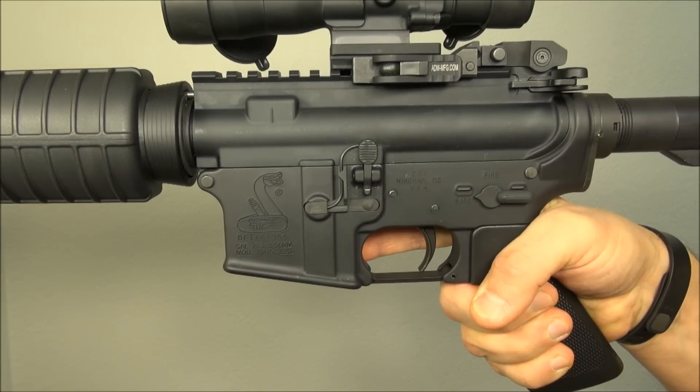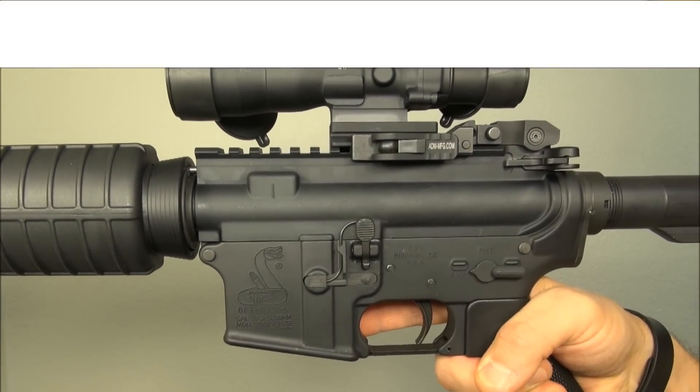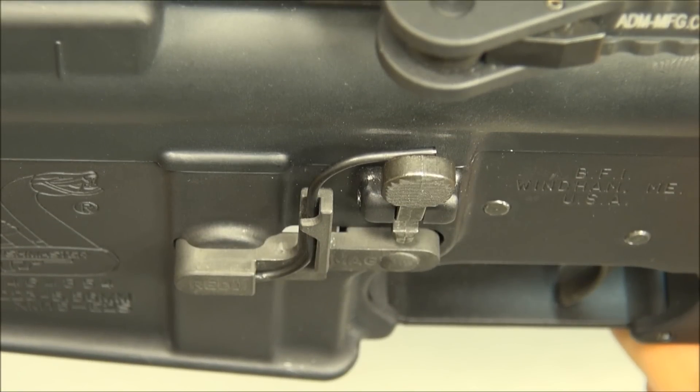Because of the elasticity of the spring steel wire, the magazine catch can be depressed at any time or the entire time the bolt is being pulled back, as the bolt catch paddle can freely move through the different stages of the cycle.